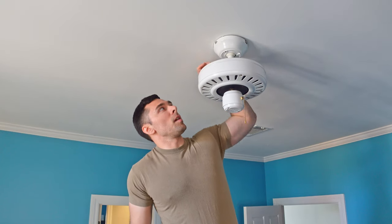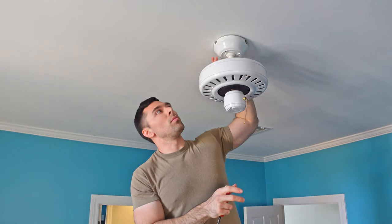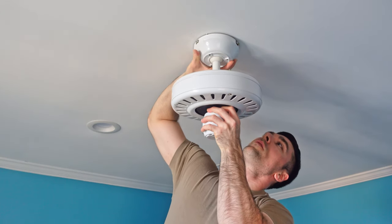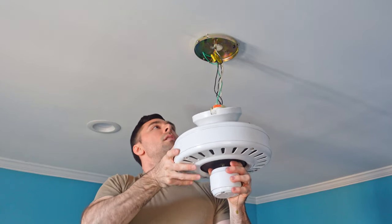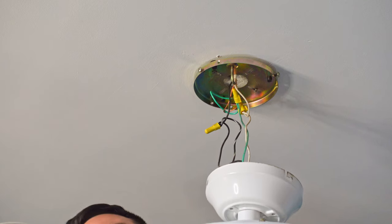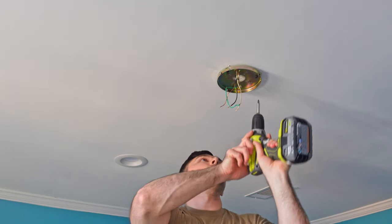Now that the blades are out of the way, I have three screws up here along the top that need to be removed. They secure this piece right here, which holds the assembly up here. As I push up on this, what secures it in place is this. With those two loosened, I can now turn it and it can drop down, so I don't have to remove those two fully. There's nothing else holding it up for this particular style, so this is securing it in place. Now all I need to do is undo the wire nuts, because the only thing securing the body of the fan to the ceiling at this point is the electrical wire. Next, I just need to remove — we'll call this the base plate — I've got two screws holding it up to the ceiling, so I'm just going to remove those with a drill.